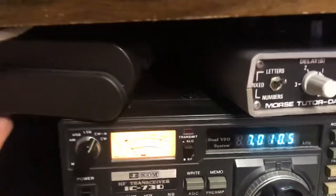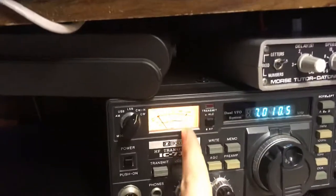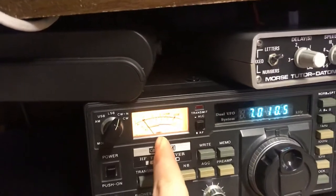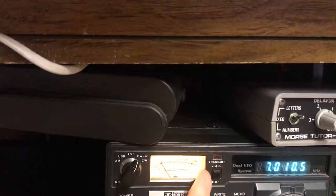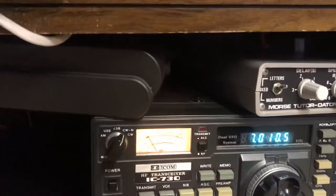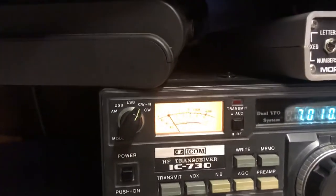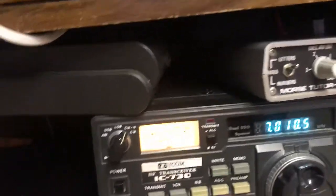Another feature is, if you move this out of the way, you'll notice a slight hatch. In there it's got a built-in SWR meter, so you can click a switch and use it as an SWR meter to tune your antenna, which I think is brilliant. There's also an NB to tune into the frequency more narrowly — you can switch it from narrow to wide in there. There's also a slot in there for accessories or add-ons, which, believe me, you cannot find them anywhere. You could get add-ons back in the day to modify these just through that little door.